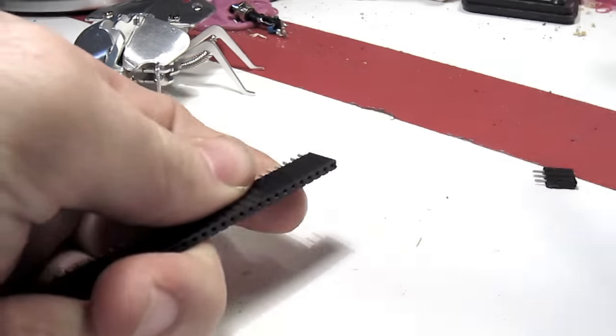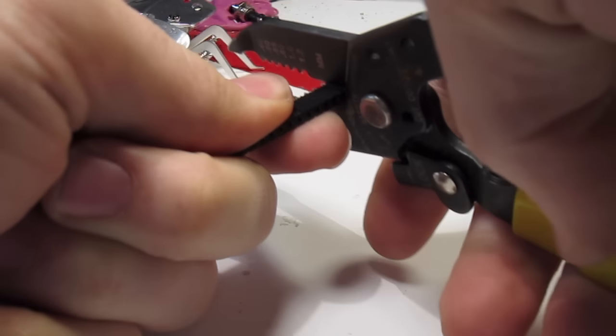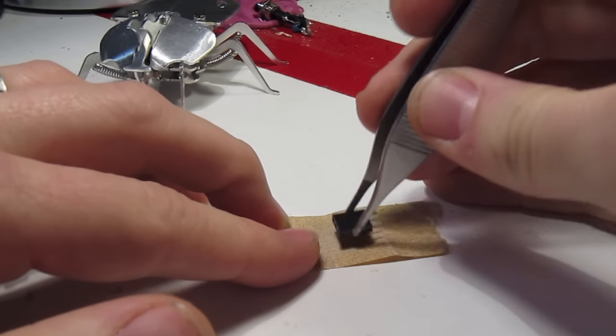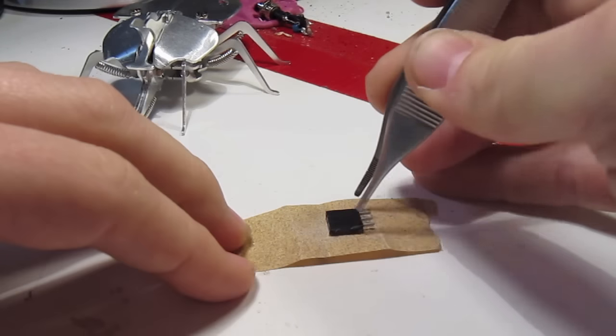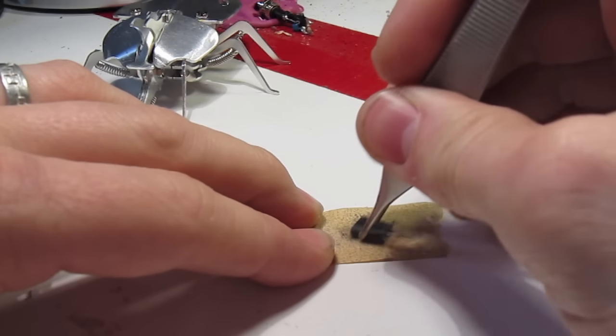build your own. We take the common electrical component, the header, which you can buy from DigiKey or Mouser, and cut them into three connector segments. Then you want to carefully sand each side of the header so that it will become rough, which will make it easier to glue, which you will understand very soon why we do that. I've sped up the sanding process in the interest of time.